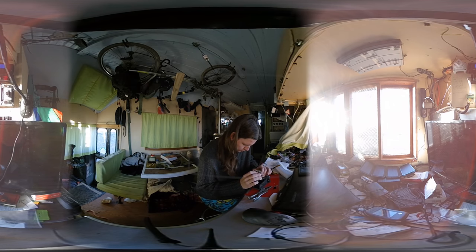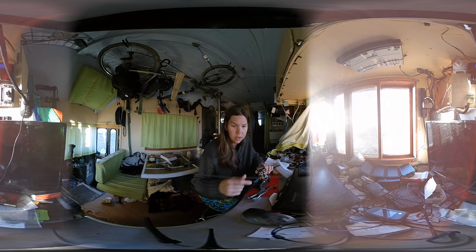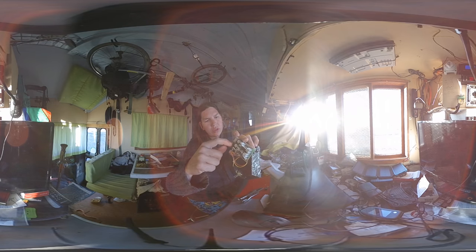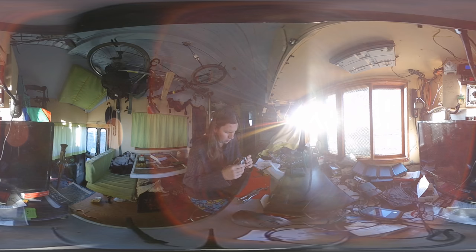The wire looks good. It's this joint right here that I've been having problems with. I'm going to desolder those and just do a straight wire solder. These connectors are really handy for screening, but I've been having a problem getting a good ground connection and it's actually been killing it. I'll go over the solder joints — I don't see anything physically wrong, but I'll hit it with the soldering iron and see if that fixes the problem. I'm also going to pull out the fuse.